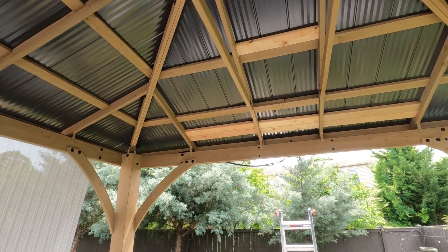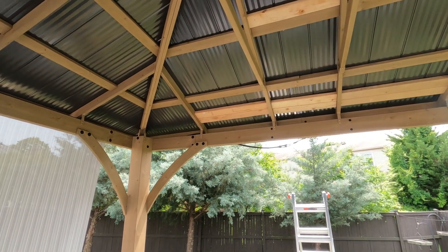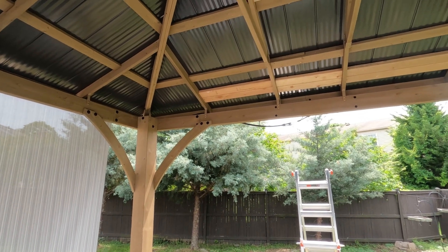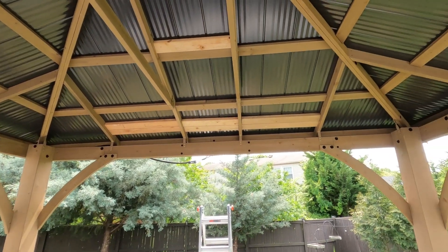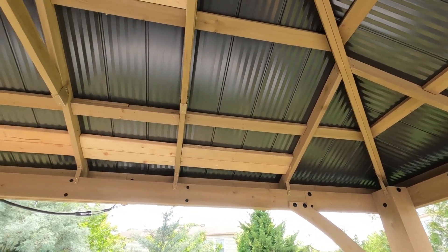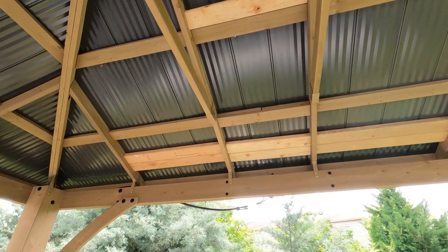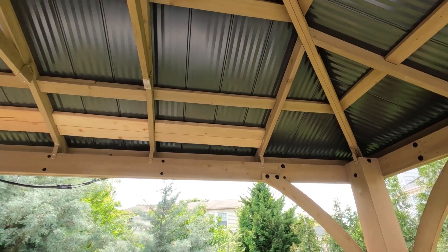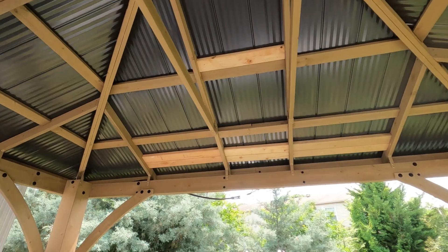You've got limited real estate up top, and that's going to limit how many panels you can put — whether they are the smaller 100 watt, 200 watt, or even 400 watt panels. Obviously you also need to consider how you're going to secure them underneath. They use simple self-tapping screws, and I added in these extra two by fours to help secure them into the actual roofing material.